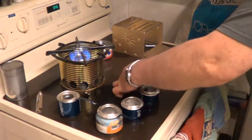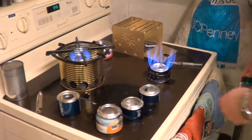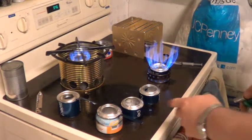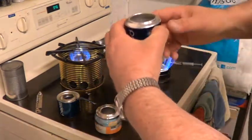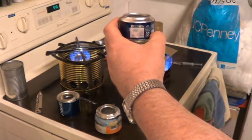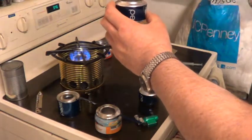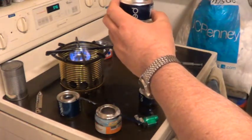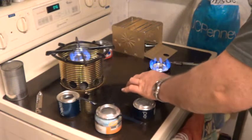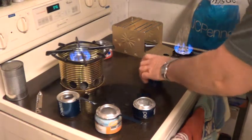The reason I like these double-wall constructions — there she lights. That'll take a while because I still got fluid burning off on the bottom. But double-wall constructions — here's another one: you use a full can, just cutting the bottom out back a ways on the outside, and it's got ribs or slices so the fluid comes up around the backside and up into a little gap, and it'll light that way. It works pretty good, not as well as some of the others, but it still works.